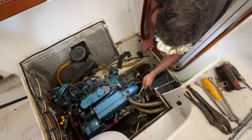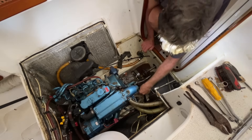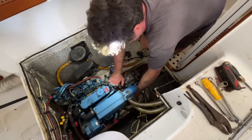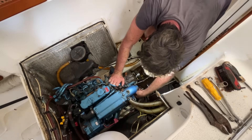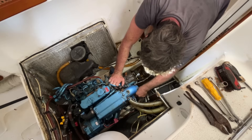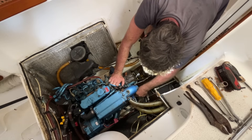I'm quite lucky on Trade Wind - I have a pretty good engine bay to work on. It's just the front side of the engine that doesn't have full access, and even that has a porthole I can take out. For this job, mostly I just need the 13mm ring spanner, a 17 and a 19 for the engine mounts, and screwdrivers - that's about it.